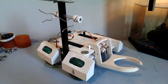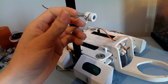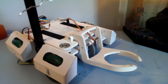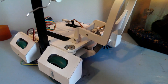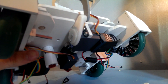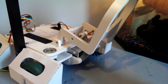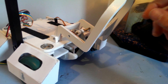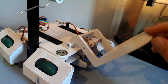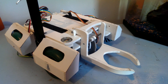In the last performance test, we added some tools to our robot chassis. We have metal clips up here which grab the pin when we run into it, and a forklift that helps pick up the skid. The forklift is powered by a servo mounted to the bottom of the chassis. This helps with space as well as torque — we have a shorter lever arm on the servo and a longer one on the forklift arms, which changes the ratio and gives us more power out of the servo.